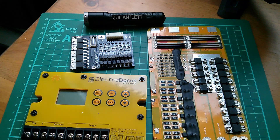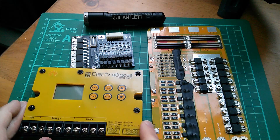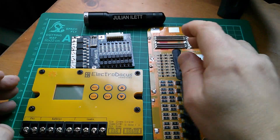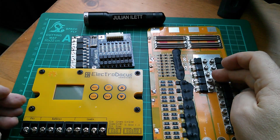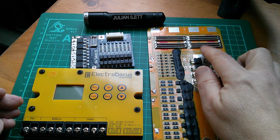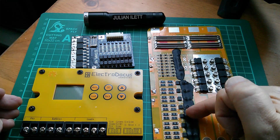So what's a BMS? It's a battery management system or a battery maintenance system. These things weren't really necessary for lead acid batteries, but for lithium they're fairly essential because lithium is very intolerant of being overcharged, over discharged, and having cells go out of balance. All of these BMSs protect against under voltage, over voltage, over current, and they also do cell balancing.